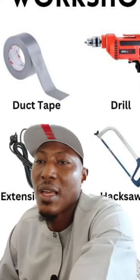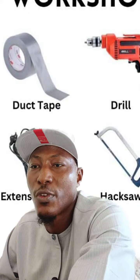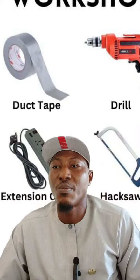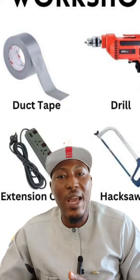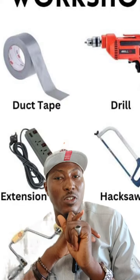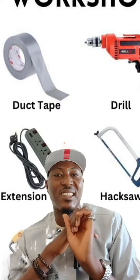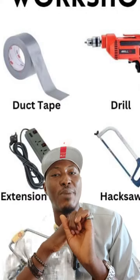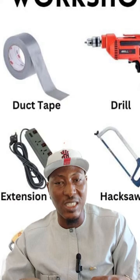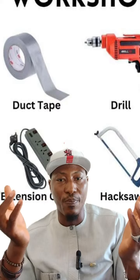Then for electronic equipment, what you do is cover or remove exposed electronic displays and controls. If they use a battery and you know you are going to store your equipment or your tractor, remove the battery heads. You get it? Remove them and clean them. Anytime you want to use it again, that is when you attach it. But if you don't do that, the battery will slowly die down. Do you get the point now?